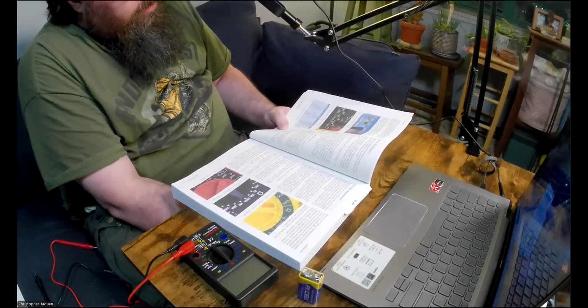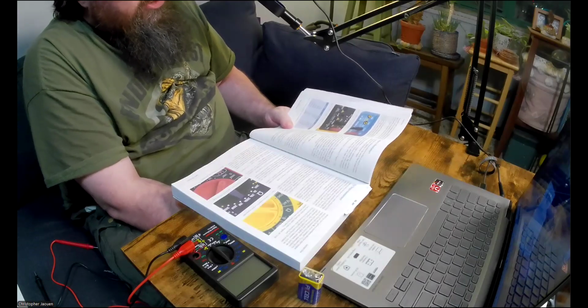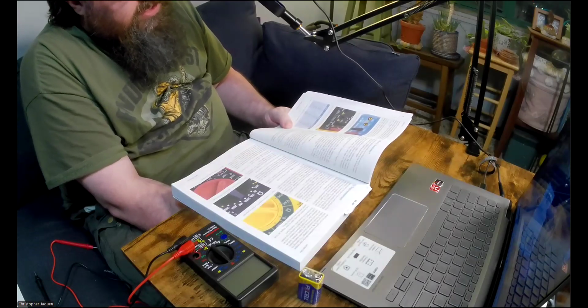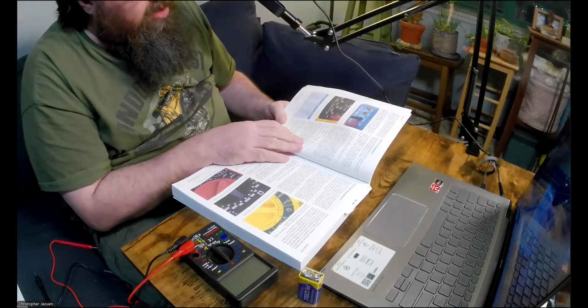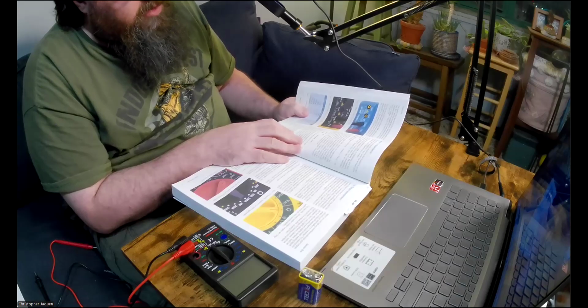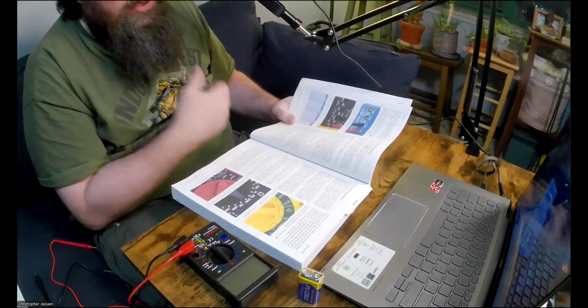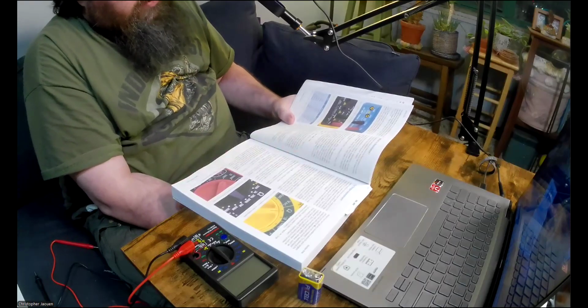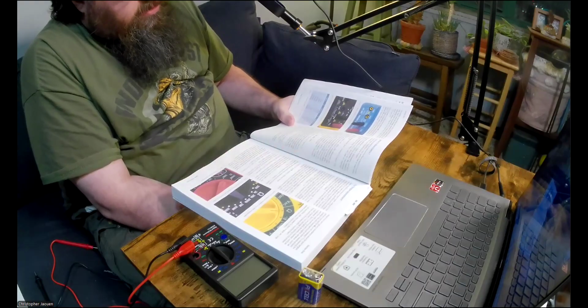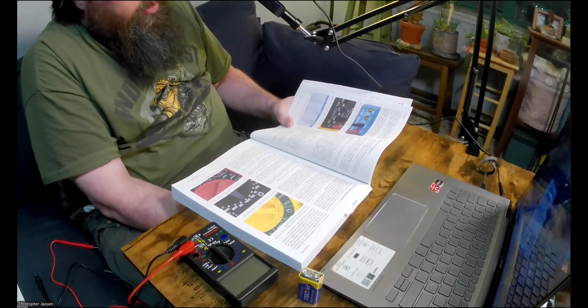Okay, continuing. Sometimes K has an omega symbol printed after it just to make things absolutely clear, but more often it doesn't. For example, a resistance of 1,500 ohms will usually be referred to as 1.5 K. And if you have above 999,999 ohms, uppercase letter M is used, meaning mega ohm, which is a million ohms, or 10 to the 6. In everyday speech, a mega ohm is often referred to as a meg. If someone is using a 2.2 meg resistor, its value will be 2.2 M.